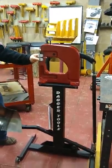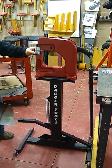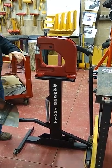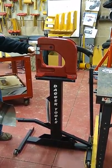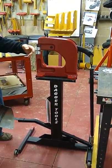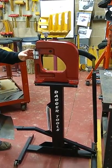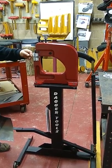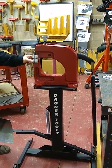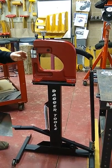That's a byproduct of the jaw size, even though we have a much smaller jaw design than the old Airco or Marchant-style machines in the marketplace where their jaws are significantly bigger. In our operating manual we show you where you can actually sand back the edges on the bottom jaws and create a radiusing edge into the jaw face. Because we produce so much force with this style of machine, the small reduction in gripping area is inconsequential when it comes to loss of shrinking force.